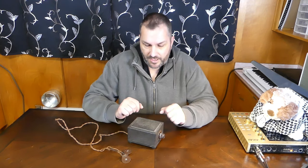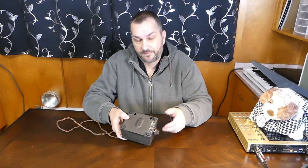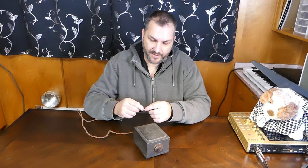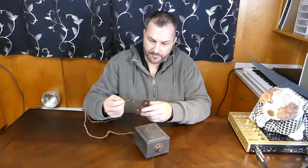Since this thing is about 100 years old, I figured it's probably the oldest one on YouTube. We'll take a look inside together. It appears you can remove the bottom by prying it off, although it also has this little riveted-on space that says 'fuse,' so there would have been a fuse in addition to the other passive components. The model number is JA — Juliet Alpha — and it was made by the Radiart Corporation of Cleveland, Ohio, between 1924 and 1927. The paddles are mounted on wire that almost has a modern vinyl-type insulation on it, with badly frayed cloth insulation on top of that.